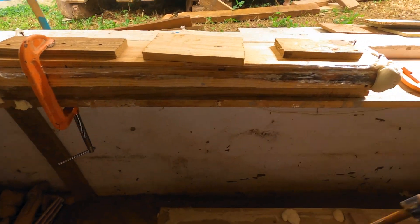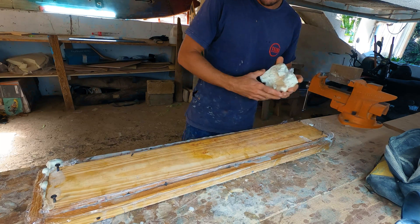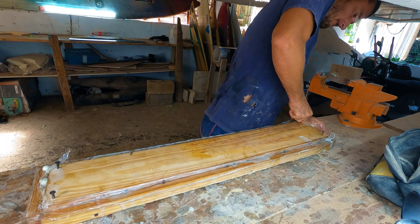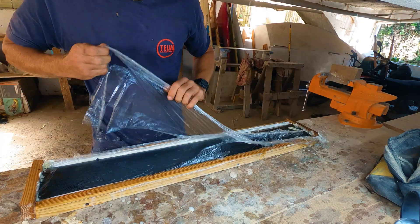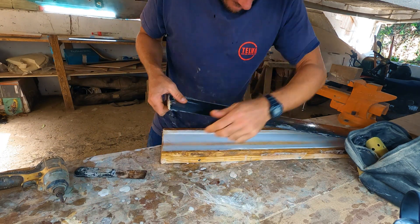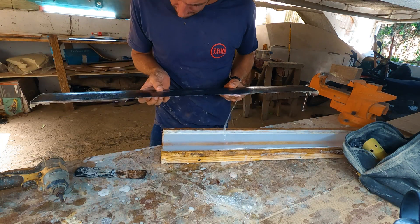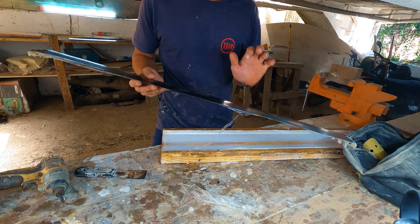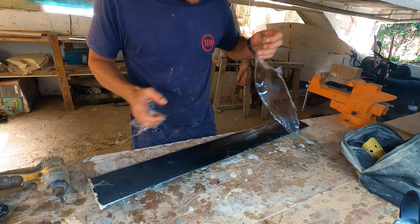The following day, I open the mold and remove the mast. As the foam expands, the carbon and epoxy get pressed hard against the walls of the mold, resulting in an outcome similar to bladder molding. I noticed two dry spots right away, but they weren't too bad. Since the mast will later be receiving a hot coat of epoxy, it will saturate the dry spots.